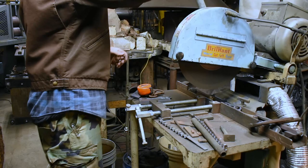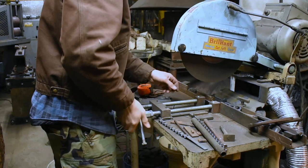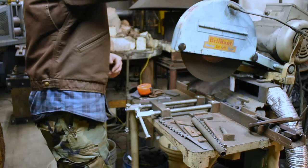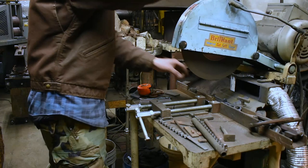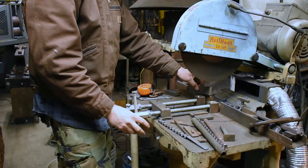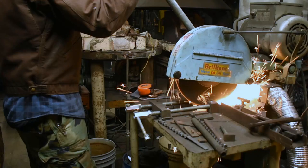Welcome back. In this installment we're making more pattern pieces and finishing out fabricating most of the elements going into this knife billet. I'm cutting some plain 1080 bar to length to make a single bar of 1080 for end caps for the billet, to trap everything together and give it a solid cap to both ends. That'll make it easier to forge the tang end down without wasting some of this precious mosaic we've worked so hard on.